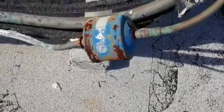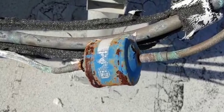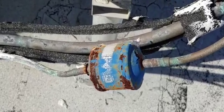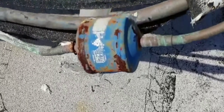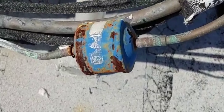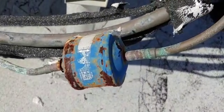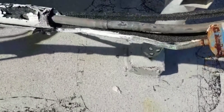The filter dryer — I've had cases where the rust actually poked a hole right through. So my recommendation would be to treat it with a rust transformer or rust remover, like the Rust-Oleum naval jelly, or at least paint it with some rust-proof primer — even spray anything to kind of stop the rust on this.